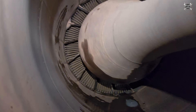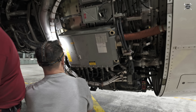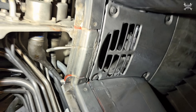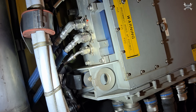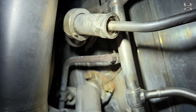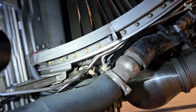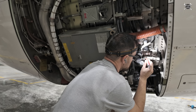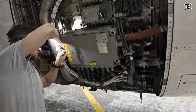The water was pushed out from the lines and we can reconnect them. By the way, P25 is an optional sensor — you won't find it on every CFM56. It measures the pressure downstream of the booster and you can find it directly behind the variable bleed valves around six o'clock, which is basically the entrance to the high pressure compressor. Then I connect the PS3 line, which measures the high pressure compressor discharge pressure — a very important value because PS3 and a few other values limit the fuel set by the ECU to hold the requested N1 speed. The last connection is the muscle pressure for the anti-ice valve, which actually controls the opening and closing of the anti-ice valve. Finally, I secure the lines with the locking cable.